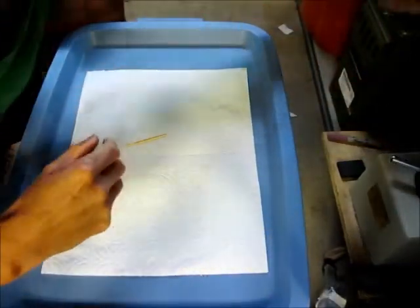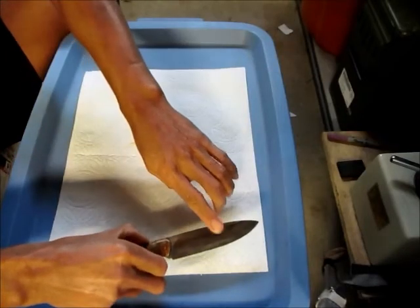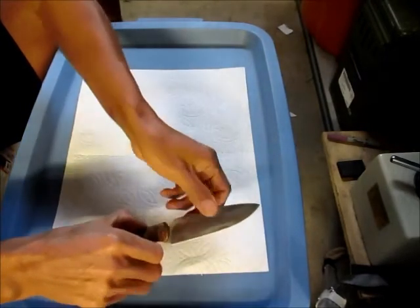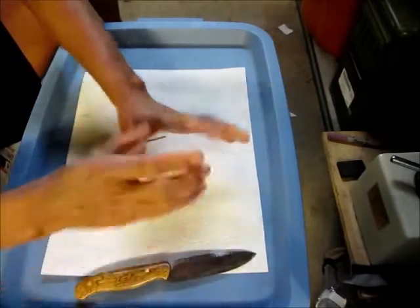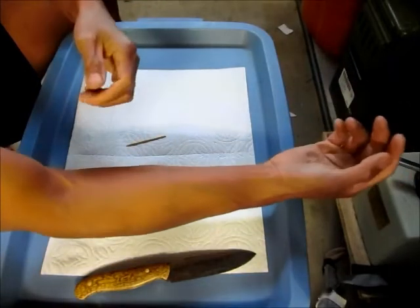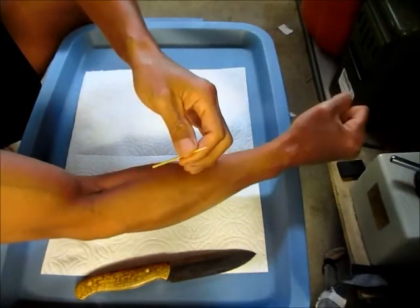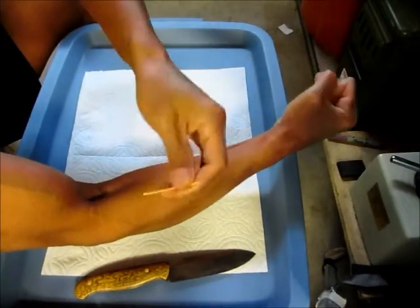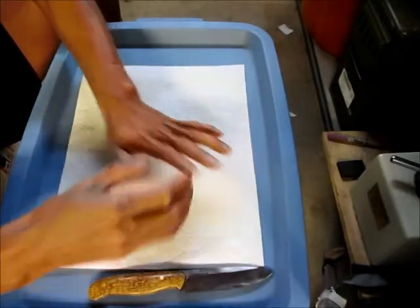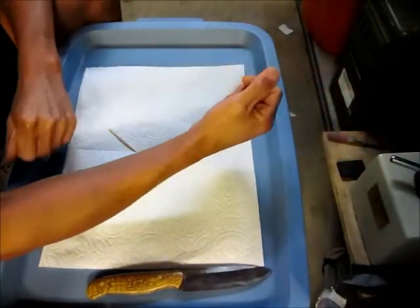For my knife, the analogy is that it's in a low stress mode and should have high load available. We need laboratory confirmation of that, but that's why it's able to have an edge at high hardness — as long as the microstructure inside is not under stress, in a relaxed mode. If this knife is at 65 and someone else's is also at 65, but theirs is already at 99 pounds of strain, it only takes a little snap to break it. That's the difference.